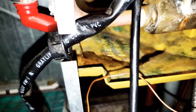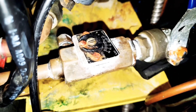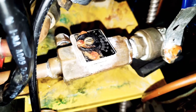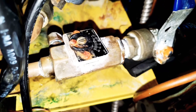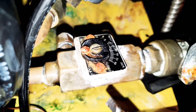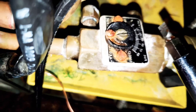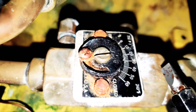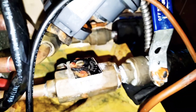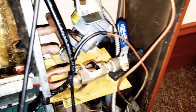So we're going to go down here, just like the balancing valve right here. You want to make sure that's open. If you can look closely, this will be closed. So we got this open — you can see the tab that says open. I'll be right back with you and I'm going to show you guys how to bleed the other side.